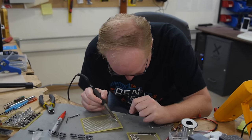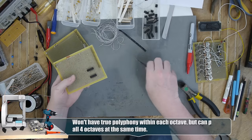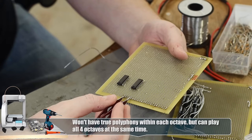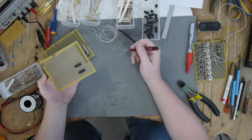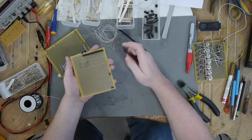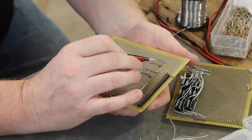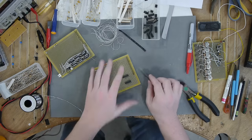This timer board should be a lot simpler than the first one that I made, but I'm still going to attach the same kind of nice and neat power rails as I did before. I started rewiring the timer board — it's actually a lot simplified. We only need eight 555s or four combo 556s. Another thing I realized is we actually don't need all these headers. We can hook up 12 of the transistors to the inputs, and the transistors will select what voltage goes on the output pin, but then all of those pins will go into a single input on each 555 timer. So I've hooked up power and ground rails, and those both go to these headers which connect to the lower board. We're going to have one of them be the frequency driver and the other one the effects driver, with a single output from each and then combined into a left-right audio circuit.